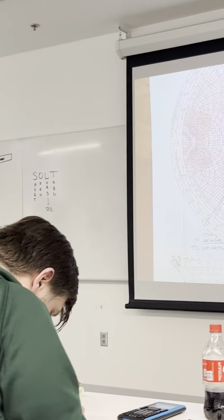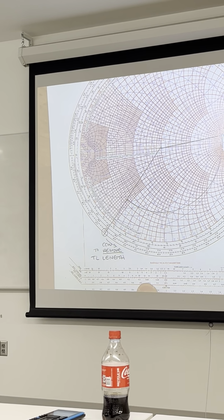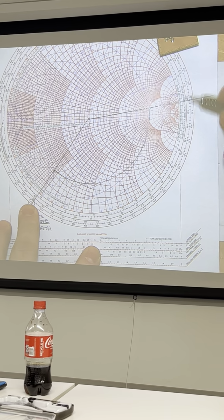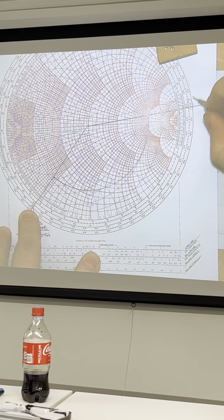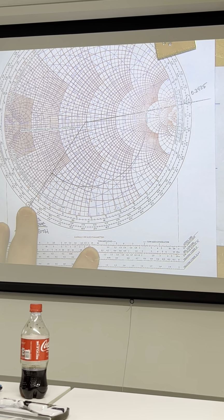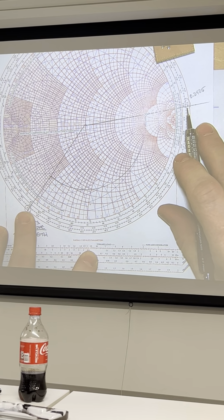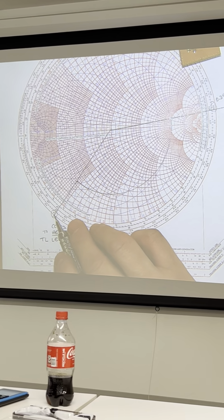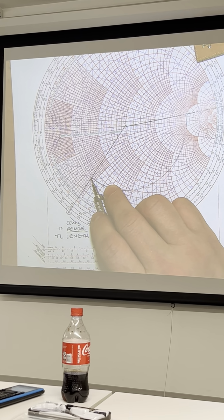What's that upper point that we're trying to get to? This point? Yeah. Over here. So I started at 0.43, and I went to about 0.2425, but I'm plotting by hand, so I did about 24.2-ish. And where did we get 0.43 from? Because that's where we started. So this is the point we measured off the VNA.